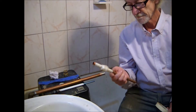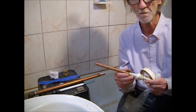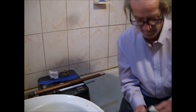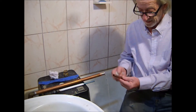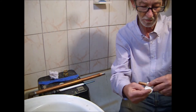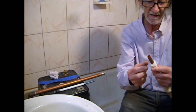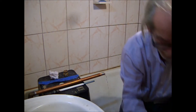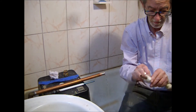The tool I call the bypass has been clearly explained by our colleague Xavier Covarrullas Olmedo in his video. Essentially what we do is wrap a ring of soft material around a smaller pipe than our piping — a 3/8 inch pipe for a 3/4 inch pipe, in this case. We create a ring with a material, some cotton in this case, in an amount in excess of the diameter of the piping. Then we cover it with a plastic sleeve like this one.